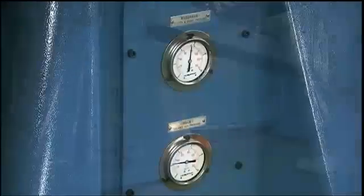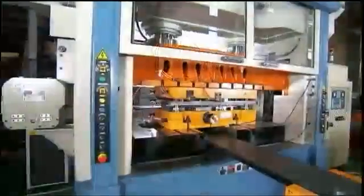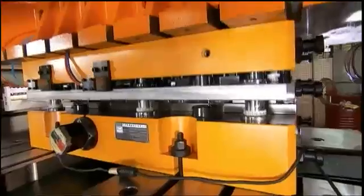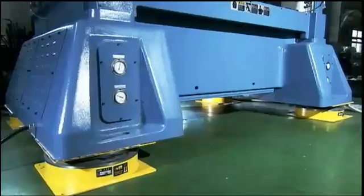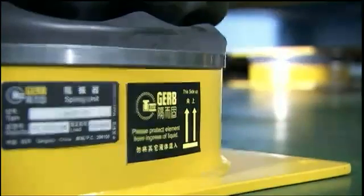This solid structure ensures the rigidity of the machine over a long period and also, along with the dynamic balance design, minimizes the vibration forces much more effectively than most other models. As an additional option, anti-vibration mounts are available for all presses to reduce environmental vibration during operation.